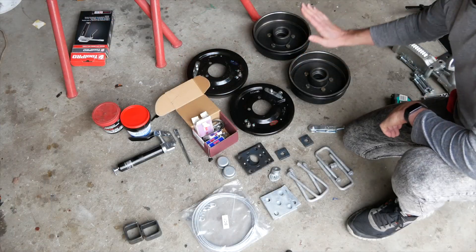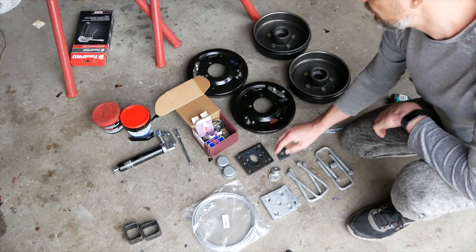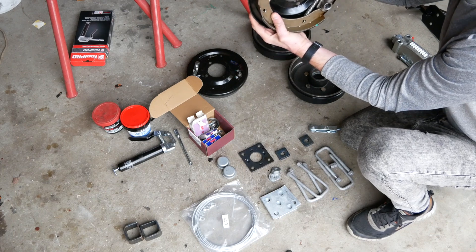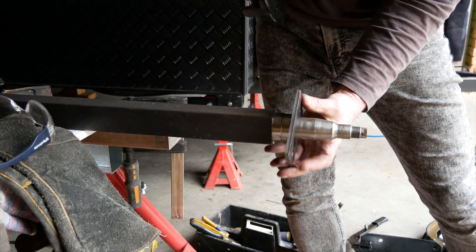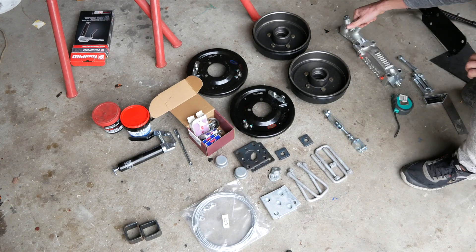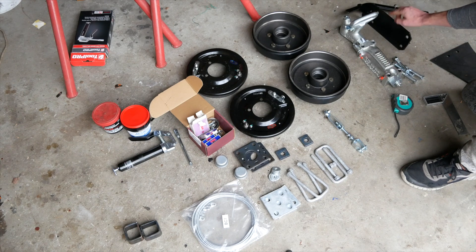Hydraulic and mechanical are fairly simple to install and reasonably similar, but mechanical brakes seemed like the best choice — definitely the easiest type of brake system to install on my trailer. The kit I purchased included two hubs, the wheels, the brake drums, the wire which is going to operate the brakes, all the bearings for the hubs, the backing plates to which the brake drums are going to be connected, a u-bolt to hold the axle in place, the pulley system, and the new coupling with all the relevant bolts and the brake lever.